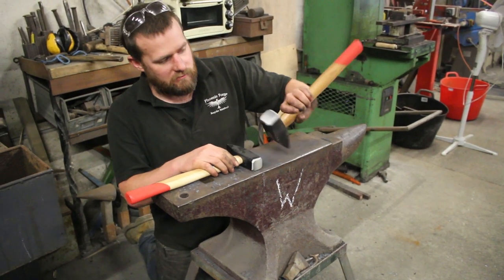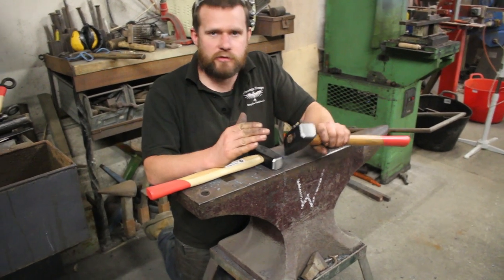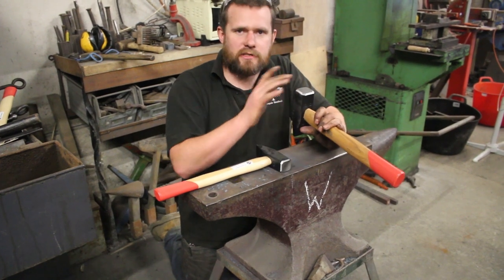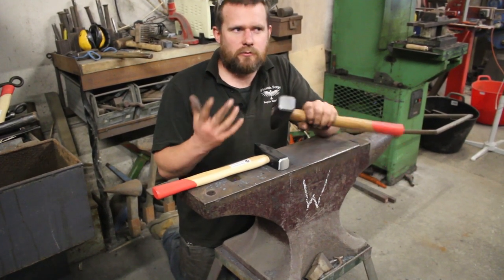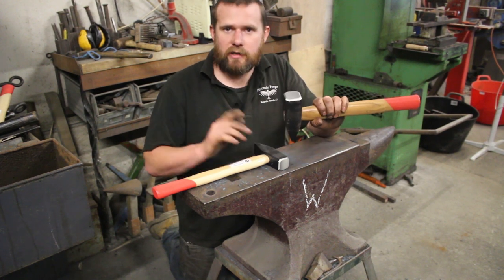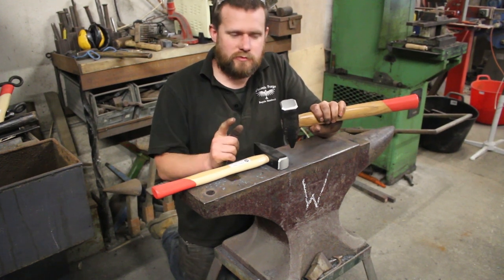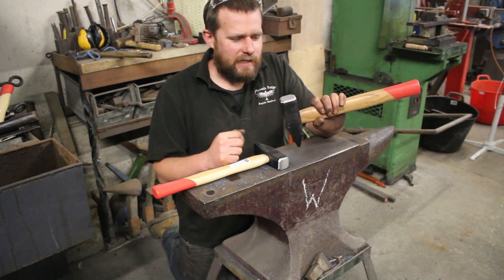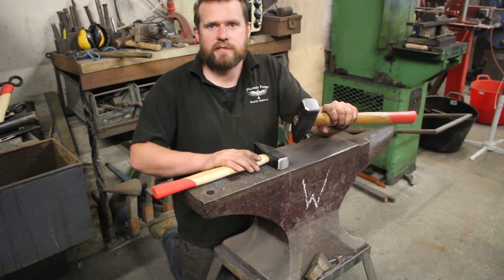It's just the same on the three-pound — they've put a 45-degree chamfer on there, but we need to radius those off and reduce the size of the contact point on the hammer so we end up with more controllable rebound when we're actually forging. I'm going to leave one of these in its original state and tidy up the other two, then I'll show you the difference.